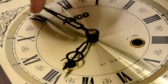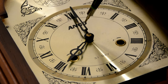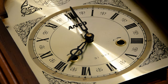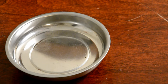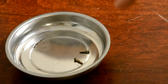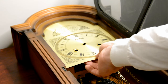Next, move the hand to the top of the hour. Whenever you're taking apart a clock face, always move the hour hand to the 12 position — the striking position — because it's easy to remember which way it goes back on. Locate the four screws holding in the dial; on this clock they're in the four corners. A tip: keep screws in a small magnetic dish like this one.